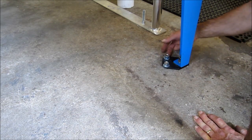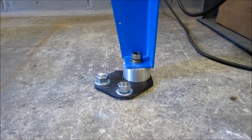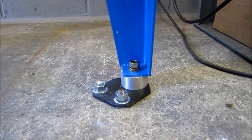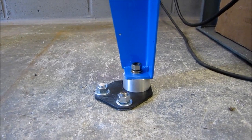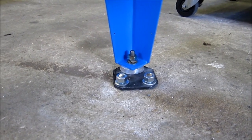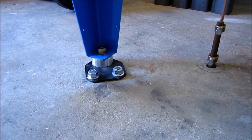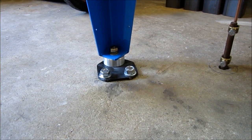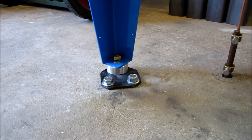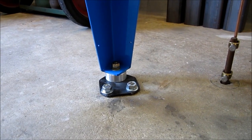This is the leg with no shim. Diagonal across from the first leg, this is one inch high — this is the lowest point of the floor. I think when Captain Pegleg poured this floor he used his glass eye. This corner under the table controller is seven-sixteenths of an inch. The opposite of that is three-quarter inch on the shim there. We don't have a stack of washers — we machined those slugs to be exactly the thickness we needed when we shimmed it and set it up.